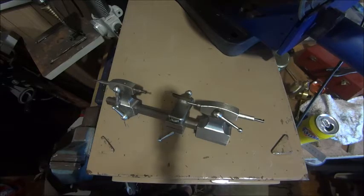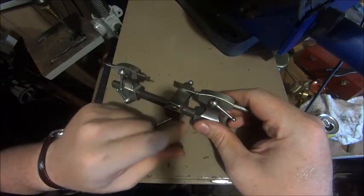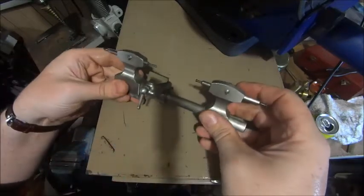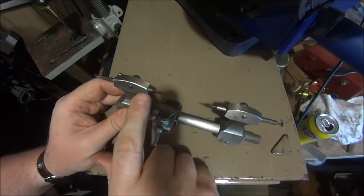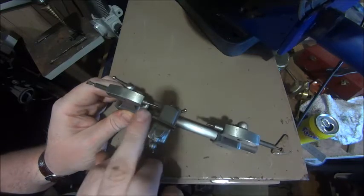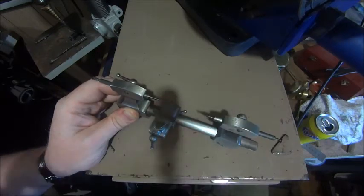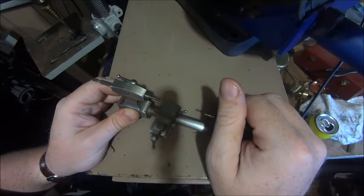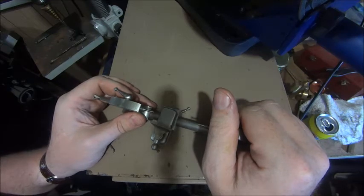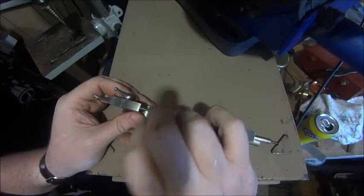Hey guys, Emma again. I've been looking at this little set of turns and doing a little bit of maintenance on them. I've got to make a pulley for this end here to run on here with a driver on it. So it needs to be brass. This is 2.32mm diameter and it needs to run pretty smooth on there. So I'm going to make up a D-bit out of silver steel, or drill rod, or whatever you want to call it, and then we're going to make a brass pulley with that - just a nice running fit on there.